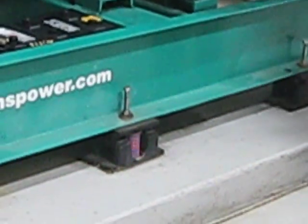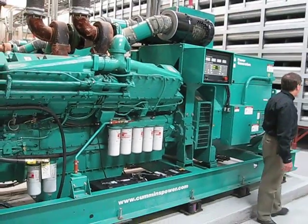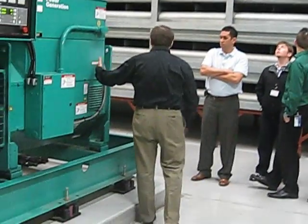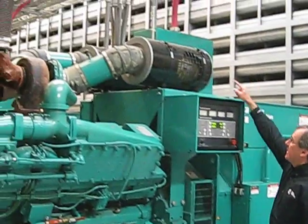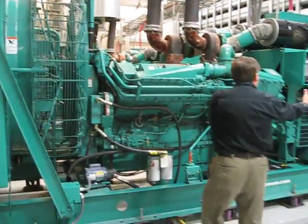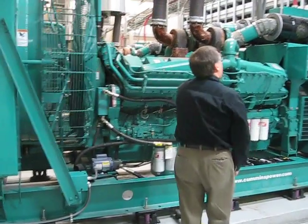You need accessory equipment. One of the biggest and most important things in a building or housing is airflow — ventilation airflow. We have to bring cool air up to the back of the generator so it can pull in to cool the generator. We have to bring cool air to the inlet to the engine, and then take that air across the engine and remove all the heat radiating from the alternator and engine.